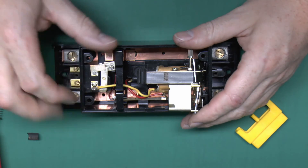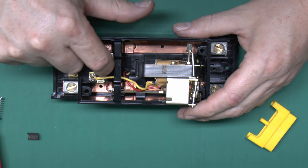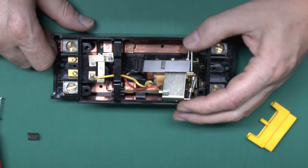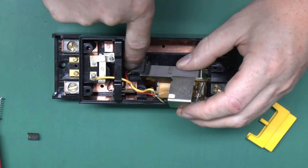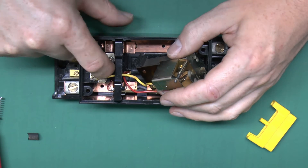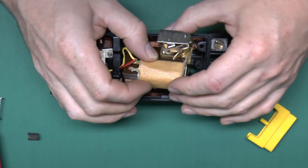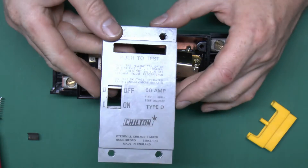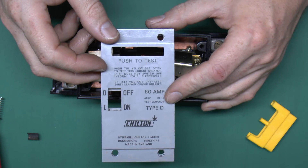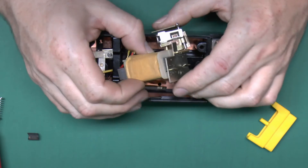One interesting thing in this design is the test resistor - or rather the lack of one. That GEC one and the usual diagrams for these had a little test resistor, so when you pressed the test position there was a resistor between the incoming line and the contact, which would limit the current via the coil. But this particular one doesn't have that - the yellow and red wires go directly to the terminals, and that's just a strip of metal linking directly to the terminal at the bottom. So no test resistor. They've obviously designed the coil to withstand the full mains across it, assuming it won't be held on for long periods. It does say to push the button often, so presumably once a month at least. Certainly holding it pressed down for an extended time would permanently energize the coil, causing it to heat up and possibly fail.